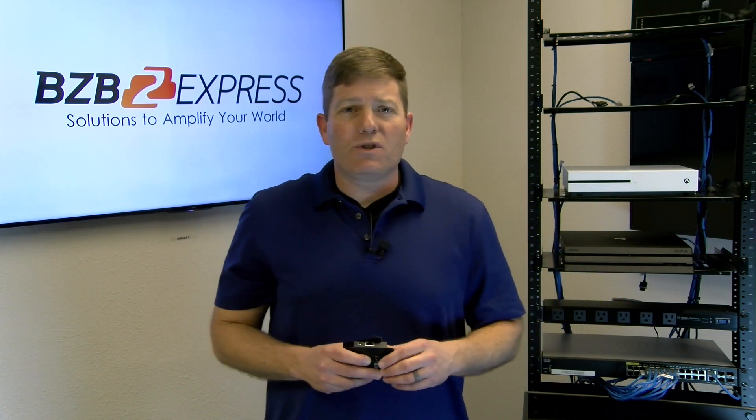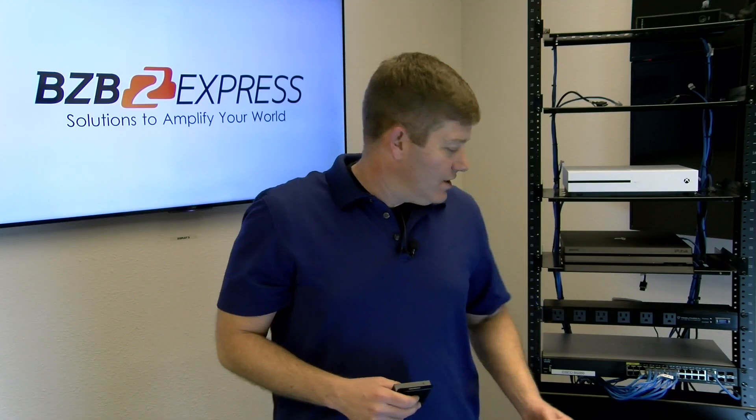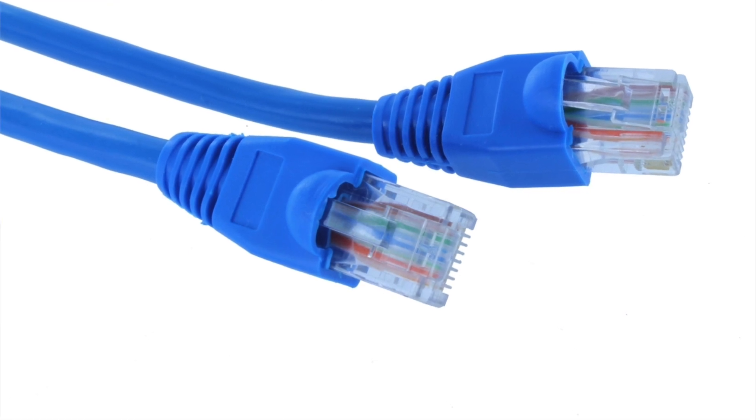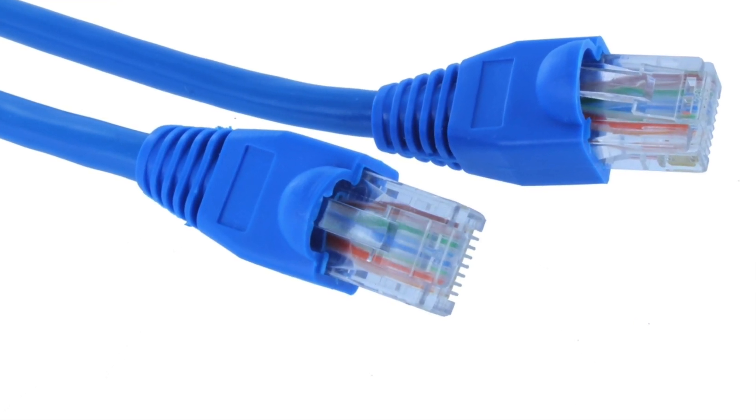The typical result, if your cable is too long, you'll see some pixelation, flickering, as well as complete picture loss. Extenders assist us in resolving this issue by using a category cable — CAT5 or CAT6 — that can carry transmissions long distances.